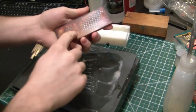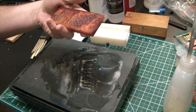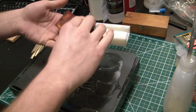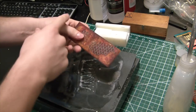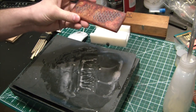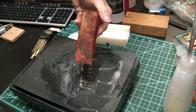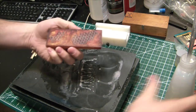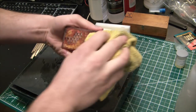At this point I just did it with 800 grit, 2000 grit, maybe 3000 grit if I'm feeling extra special that day, then some plastic polish and you're done — it's ready to go on a knife. If you're not selling these directly to a knife maker and you're using them yourself, you might as well just leave them rough, epoxy them on your knife handle, pin them up, let your epoxy cure, and then rough them to shape — that's when you bring out the good stuff. If you're not doing your finish until later, there's no sense in rushing it now. I would even make a sweet scale for my 1911 — that would just be gorgeous. That'll make somebody smile though. Beautiful.